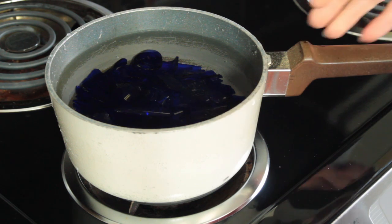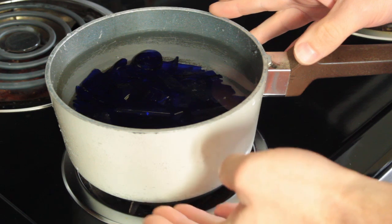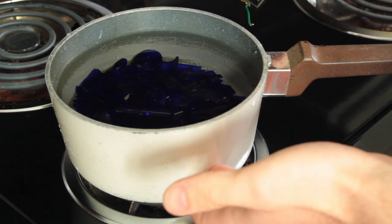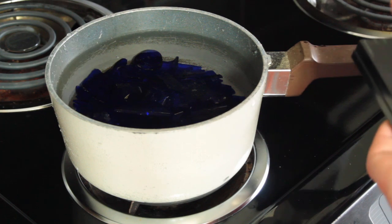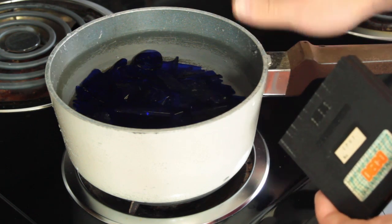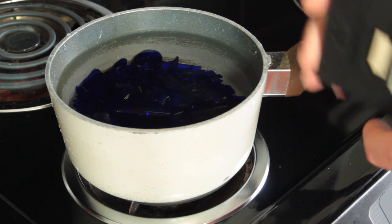Since the glass transition temperature is about 200 degrees Fahrenheit, I'm gonna try to boil it. I needed something to protect the plastic casing from the heating element — I would have normally used marbles but couldn't find any, so I broke up a bottle. That should work really well for insulating the plastic from the element and just exposing it to about 212 degrees Fahrenheit.